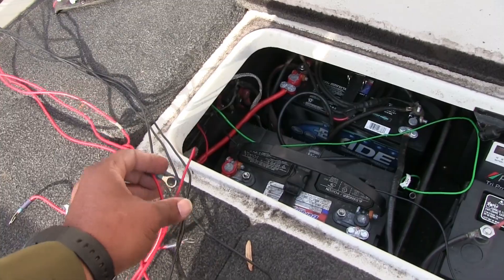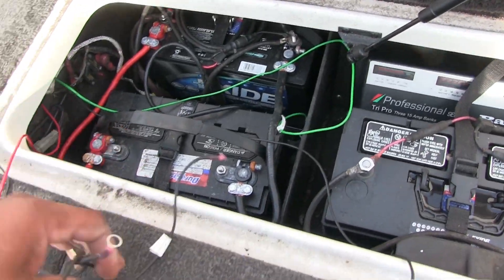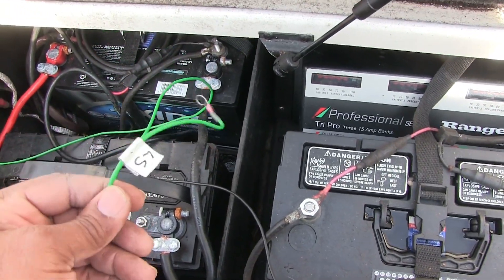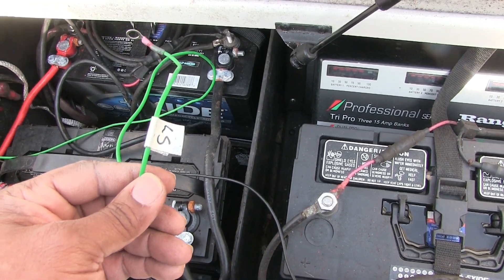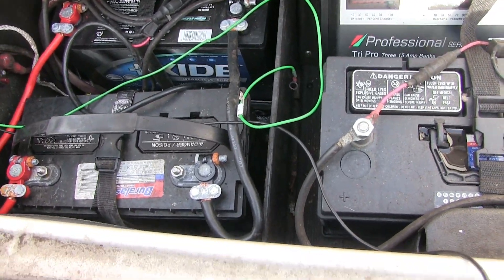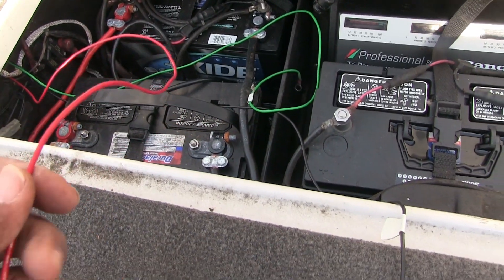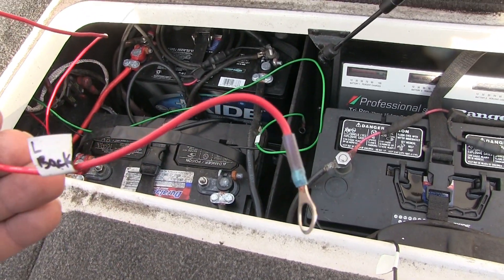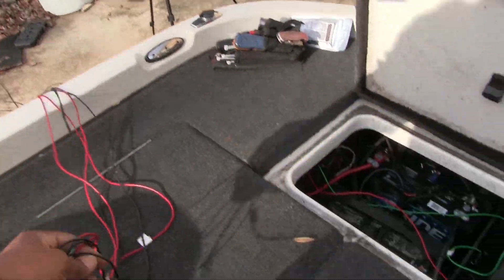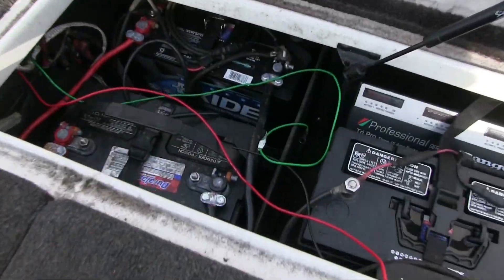Now that I've got all the power cables and ground cables pulled back from the front, I'm going to leave this green cable — this green cable is the ground for my LiveScope up in the front, which is okay at 14-gauge. And this is the power cable for the back unit; I'm going to use that as a pull string, so I'll leave that in for right now. But the rest of the cables you can use for something else if you need to.